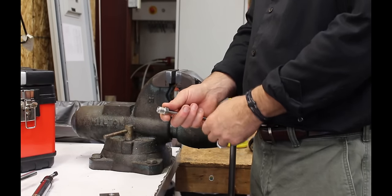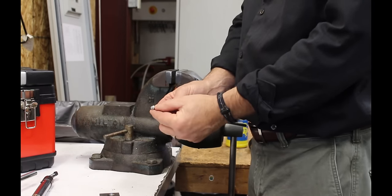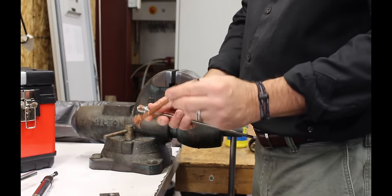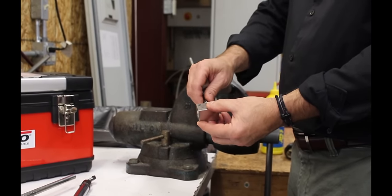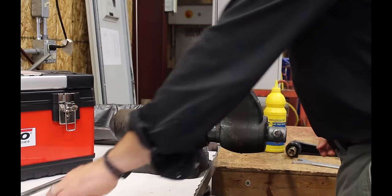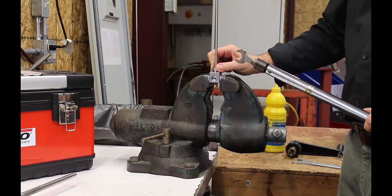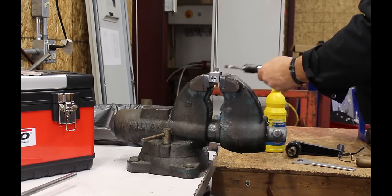When you put together a high pressure or medium pressure fitting, put the gland on the tube and then the collar, with the one to two threads exposed from the end of the collar. You're going to want to lubricate the threads on the gland — I'm using jet lube lubrication here — and this allows you to put the stainless parts together without any risk of galling in the threads. Lubricate the threads, install it hand tight into the fitting, then put it in the vise and torque the fitting. This torque wrench is set to 25 foot-pounds — that's the proper torque for quarter inch high pressure. Every different size has their own torque value. Tighten it until you have 25 foot-pounds on the fitting.